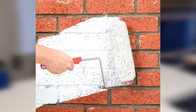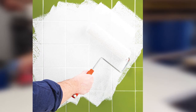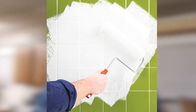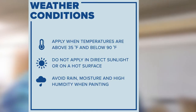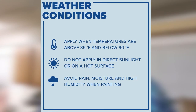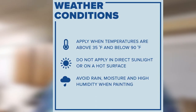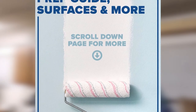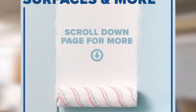There are a few problems with this product. For one thing, it's one of the most expensive items on today's list, so I wouldn't recommend it for very large projects — it's only available in quart cans anyway, making it obviously intended for smaller projects. It also takes longer to dry than most options, needing 3-4 hours where most products require only 1-2. Additionally, it should not be applied in direct sunlight, with polyethylene or polypropylene, or on hot surfaces, and it has to be kept away from all moisture for 24 hours after drying.